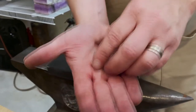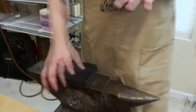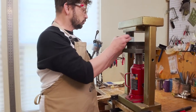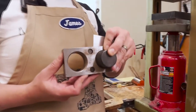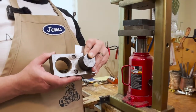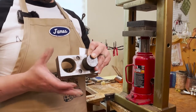If you're going to do a larger size, what's really necessary is to not use a hammer and switch to a hydraulic press. I understand not everybody has one in the studio, but if you want to punch any larger discs over an inch it's really essential, because the alignment is critical. When striking with a hammer the punch can get off-center, damage the tool, and not work as well.